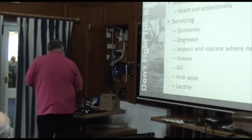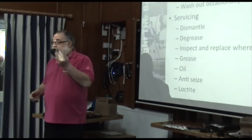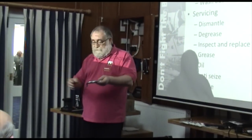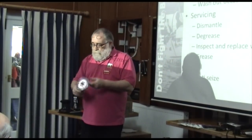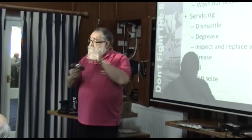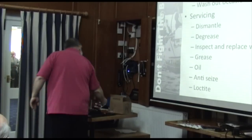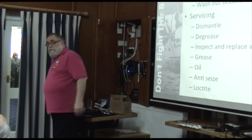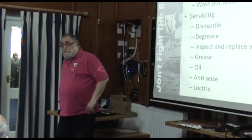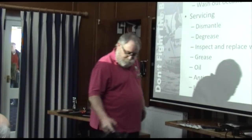That was easy. You might then need to remove the stripper arm, if it's a self-tailer, because nearly every winch is a self-tailer. And then on the Harken one again, it's loose and 3 screws, twist it and take it off. So the screws stay in place, they're not likely to go over the side. But at that point, you reach the moment where the biggest opportunity to throw stuff in the water is there. Okay? And it manifests itself in many ways.